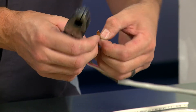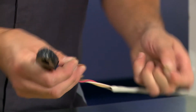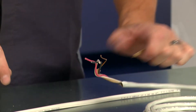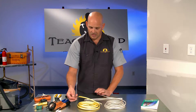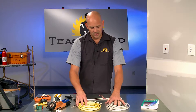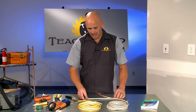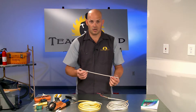These individual wires — it's 14-3 — so they're a 14-gauge. What does that mean? The higher the number, the smaller the diameter of the wire. A 14-gauge is smaller in diameter than a 12-gauge, and a 12-gauge is smaller in diameter than a 10-gauge. That's what the gauges mean, what the numbers mean. When it says 14-3, it means it has three wires plus the ground. This is 14-2, the most common Romex used in residential electrical work. This is what you'll find throughout 80% of your home.